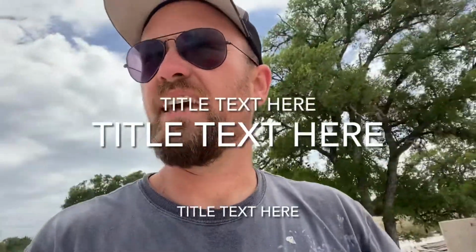All right, well, it's the end of the day here, and we had about 420 lineal feet of foundation wall that we wanted to cover with the termiticide. So it took us about, I'm gonna say 3 hours, essentially with two of us doing it. Wasn't really bad at all. It saved us about $1,700, anywhere between $1,700 and $2,700, depending on the quotes that I got. So I don't have a guarantee from a termite company, so there's that. So you have to evaluate if it's worth it to you to have that guarantee of the termite protection. I'm essentially doing the same thing they're doing, different product, I guess.